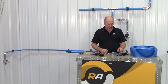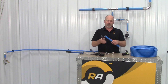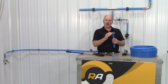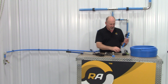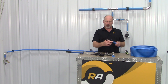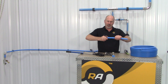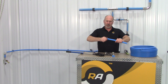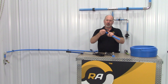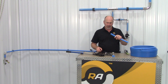For installation it's very simple. You're going to take your tubing and cut it to length with the supplied cutter. Make sure that we're not using a hacksaw — we want a great smooth straight cut. Next we're going to deburr the tubing. It's very important that the inside of the tubing is deburred with the supplied deburr tool. This makes the tubing round so it's easy for the fitting to be inserted, and the fine teeth will cut the edge of the tubing and make sure that it's smooth and ready to insert into the fitting.